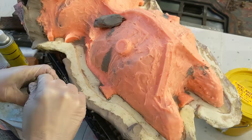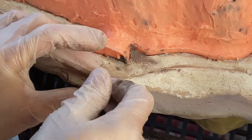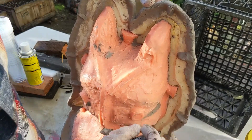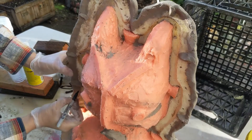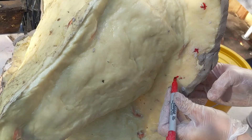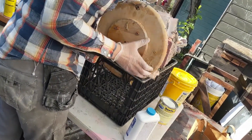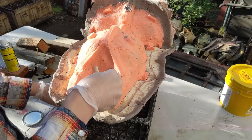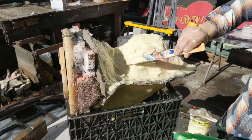For the final side of the mold, the only clay buildup I need to do is to make a clay flange along the edge of the epoxy, so I have easy access to the inside seam of the mother mold to pry these pieces apart using a screwdriver or a pry bar. Something I forgot to do when I laid up my first side was to mark where I'm going to be drilling my bolt holes. Since I have a lip key going along the edge of the mold, I want to mark above that lip along the inside of the mother mold and transfer those marks with a sharpie on the outside so I know where to drill. The rule of thumb is that the hole should go about a half inch away from your silicone and about three or four inches apart from one another. Now I apply some paste wax and, after a final spray down with spray-on mold release, it's the same old layup story all over again.